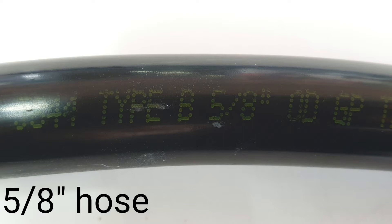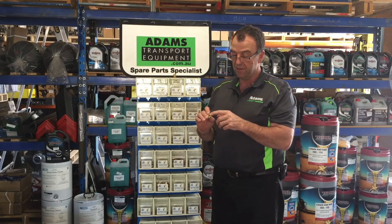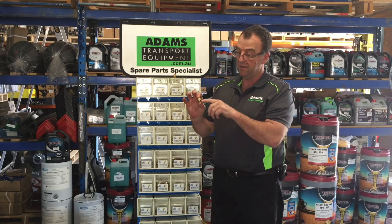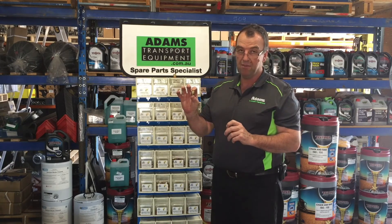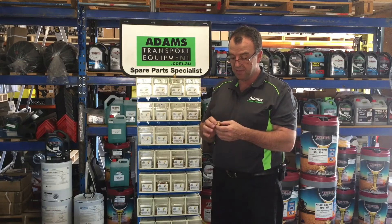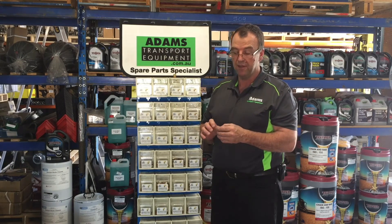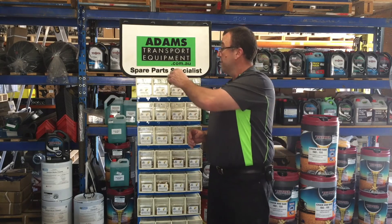As we've said previously, it's repeated about every half metre down the line. This fitting is a 3/8 hose size again, and M16 metric thread. You can tell it's metric — straight cut with the o-ring that seals. So as ever, it can be metric hose with metric thread, or imperial hose with metric thread. That's the straight fittings of the 68 series.